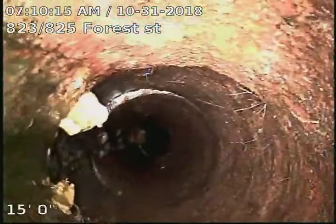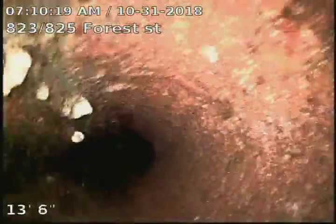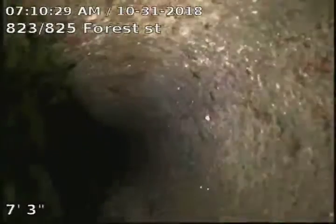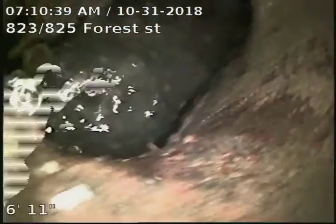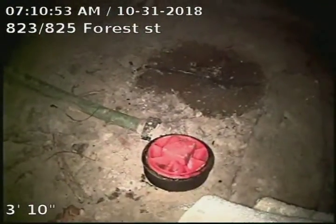There's our cast iron to clay connection there at 15 foot, so cast iron piping in the crawl space through the foundation wall to 15 foot, clay piping into the city sewer at 67 feet. Here in the cast iron the line is just a bit flat before it leaves the house. The clean-out also needs a new plug.